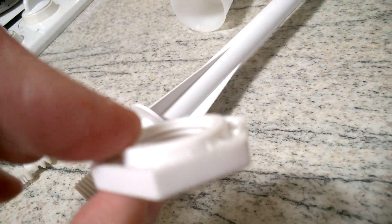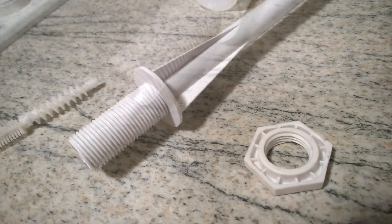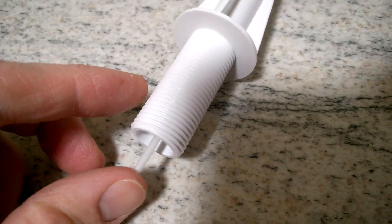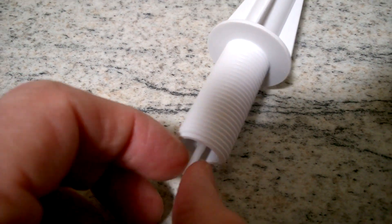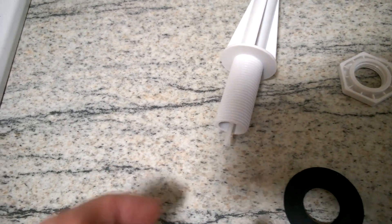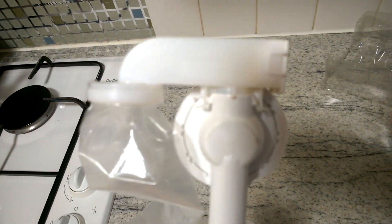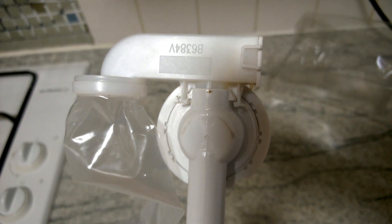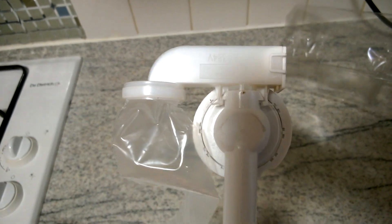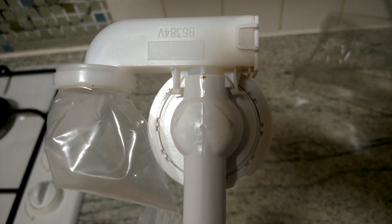The nut goes at the bottom that way up, so this piece here touches the bottom of the tank system. Another little note — this seems to come to a stop at that position, so you can only push it in so far, and that's as far as it goes. That is designed to stick out a little bit and it won't matter because that's going into the water pipe. By the way, you can't swivel this at all once it's in position, so once it's in it's either correct or you're going to have to snap it off gently and turn it around. That's why it's good to get it in the right position first, because the more times you do that you might end up weakening the plastic and snapping those little jaws.